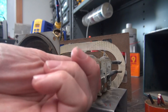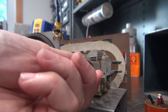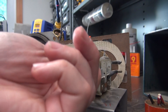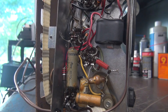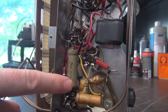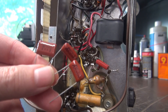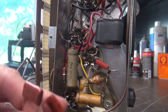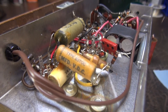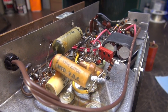She is receiving — there aren't too many local stations in my area, but that's a really good sign. Unplug it, let's change out those wax caps — we're about done. We're going to swap these old drippity-doos with Panasonic type caps rated at 630 volts. They're very inexpensive and a great replacement. We do them one at a time so you don't lose track of what you're doing.